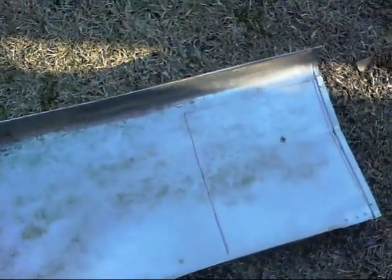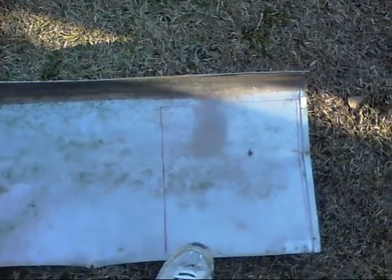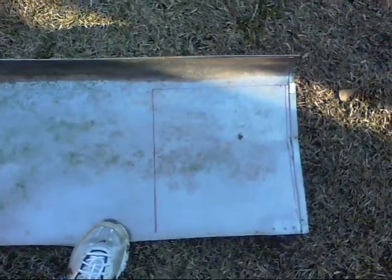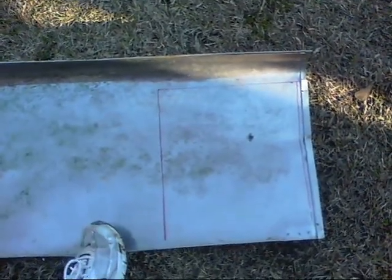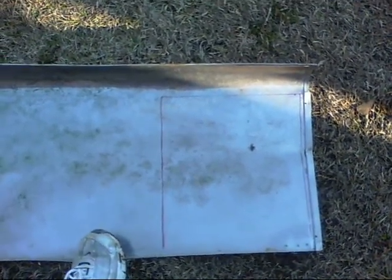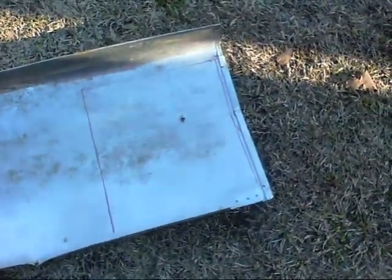What I'm making today is a stainless steel parts bin. This is a piece of stainless steel I had from the scrap yard. I've drawn out my dimensions on it and I'll now cut it out and bend it on the brake — hopefully it'll turn out to be a pretty decent little parts bin. I need this whenever I disassemble fine stuff such as a carburetor, to put my parts in so they won't get lost.